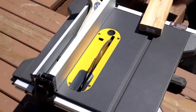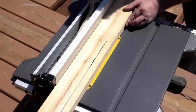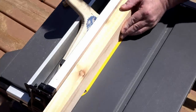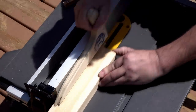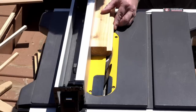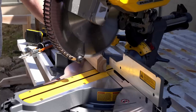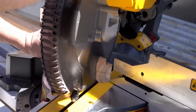The rim for the top is eight pieces that are 15 inches long. First I need to cut these shorter two by fours down to the correct size, and then cut a rabbet that will receive the boards for the top — I'll do that in two passes on the table saw. After cutting the rabbet, I set the saw to 45 degrees and cut a chamfer on the outside, which is mostly decorative. Then I cut these into segments and the angle cut on the end is 22 and a half degrees, because the top has eight sides like an octagon.